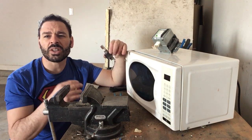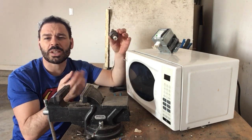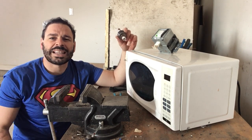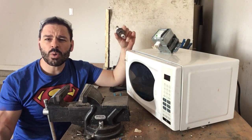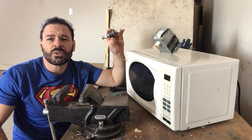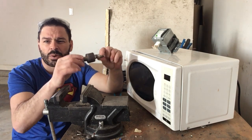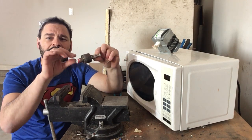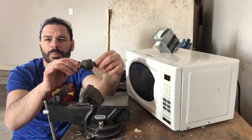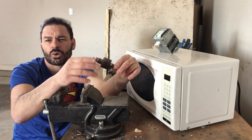The reason beryllium is so dangerous is that if it is crushed open and releases beryllium dust, you can get berylliosis, which is a metal poisoning. It could lead to lung cancer, increased chance of pneumonia, and other harmful lung diseases. Someone might ask why I'm handling the ceramic without gloves or a mask — and again, intact it is harmless. It is only when it is crushed or broken open that it could release the beryllium.